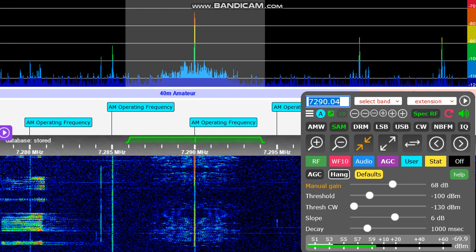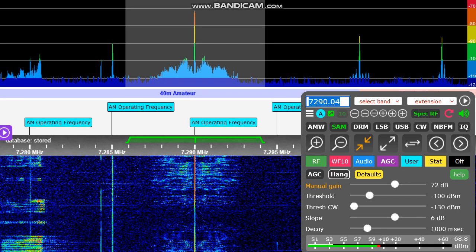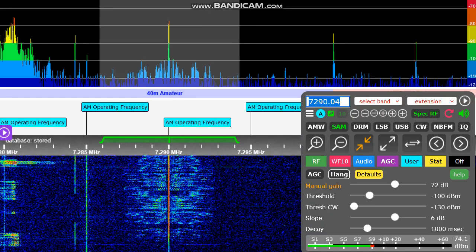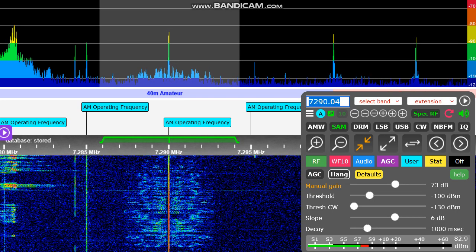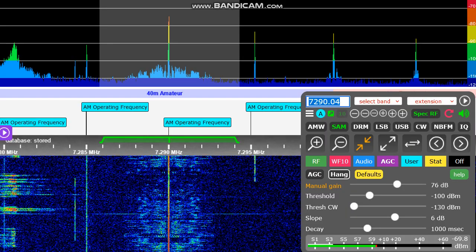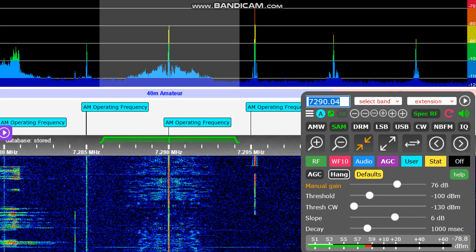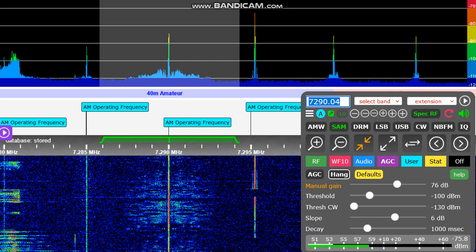might be the main issue. Looking to swap it out with my dipole, I think, later today to improve the signal here on 40 meters. It's an end-fed compromised antenna on this end, running about 25 watts from a Kenwood 590 SG, right outside of Corning, New York. Name is Bill, Bravo India Lima Lima, and again, we're just outside of Corning, New York. Fairly low power and a compromised antenna, but we thought we would try N2DTS from W2MX.